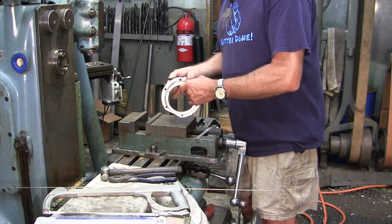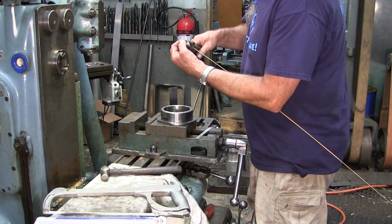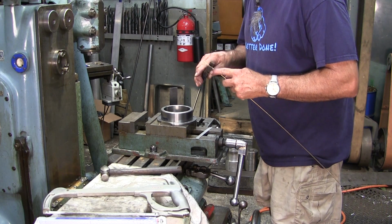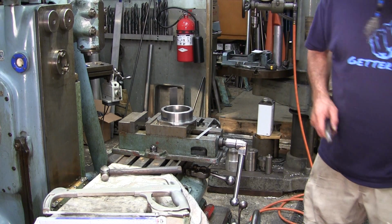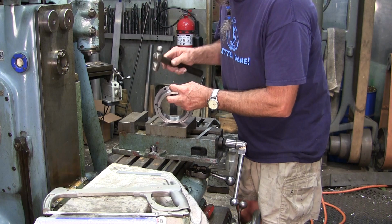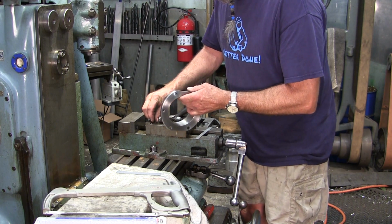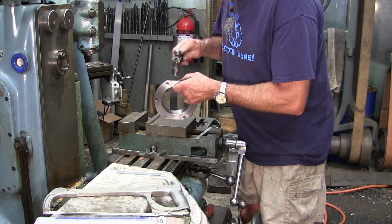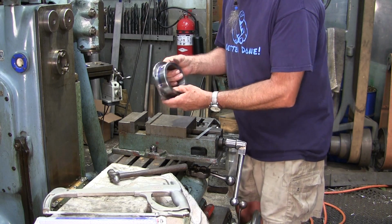spoon on a keyway. So what I want to do is put in two pieces. I have some silicon bronze brazing rod here, or TIG rod, and I'm just going to take my cutters and cut two ends, because the ends are really good and they fit in kind of snug. I'm not necessarily going to try to tap them all the way through, but if I can get them started in there to where I can take a punch and punch them back out, I'll be doing just fine. All right, so I'm just putting these in here so that I know it'll stop my hacksaw from going down into the opening. I don't care if I put a hacksaw scar on the silicon bronze rod. That one went in pretty good there. I'm not going to try to force it any more than that.